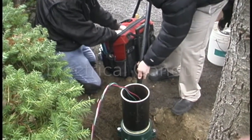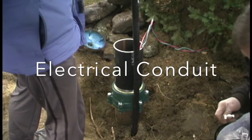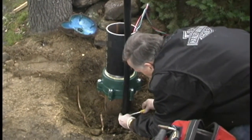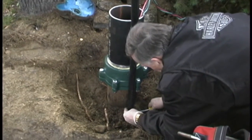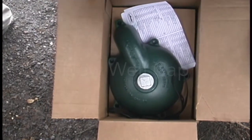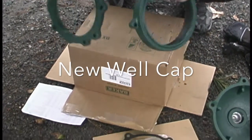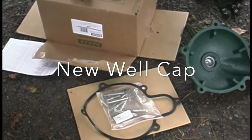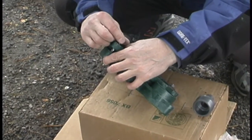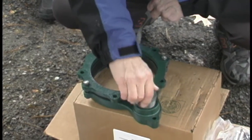Next we've got to put a new conduit. The existing one that was coming up, we took a large one and put it around it and shrunk it down. We're going to put a clamp on there so we'll make a good seal, because we've got to extend that up to the cap area and it's just too short to do so. Here's the cap that we use — these are all cast iron, it's the best you can buy. They are a compression type cap — it just squeezes around the casing and forms a nice tight seal. We pre-assemble it with two bolts, the starting bolts, and we put a nipple in it — and that's where the conduit is going to come up.